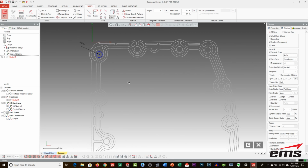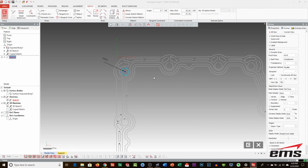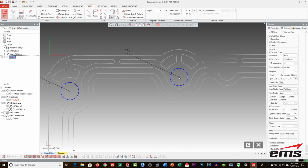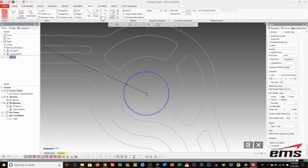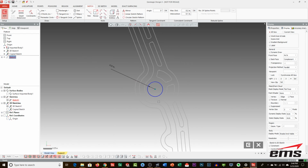And now I want to repeat it. Now, this isn't a clear bolt pattern, so trying to use a linear sketch or circular pattern really isn't going to work here. So I'm just going to pick it, copy it, and the way Design X works, wherever you have your cursor, when you hit paste, it pastes it there. And if it's not perfect, you just kind of grab it and move it around and try to line it up. And you could build some construction geometry, like if these two are supposed to be in line. Just for this demo, I'm not. When I get them right in line, you see it shows me a little line. So there are some tools to kind of help you. But this geometry is so kind of free floating, or not free floating, but not in a typical pattern. Okay. But I'm copying the exact same radius, and I'm getting it lined up.